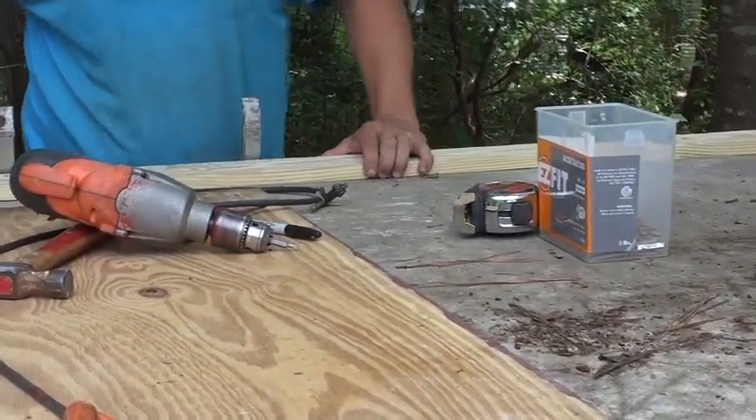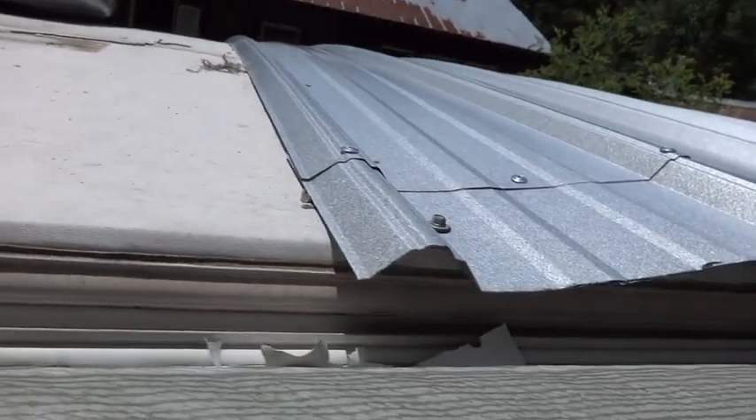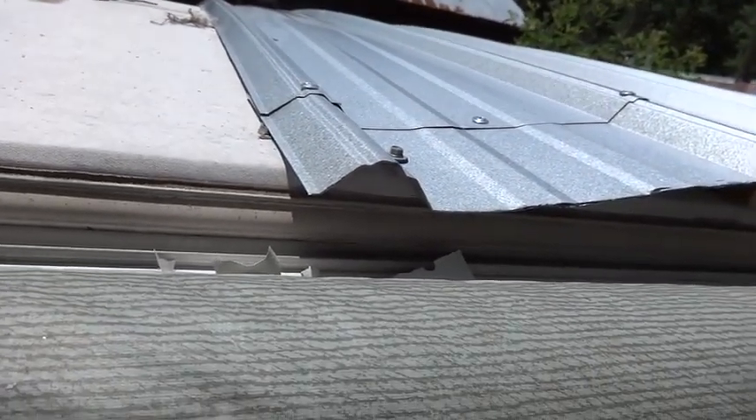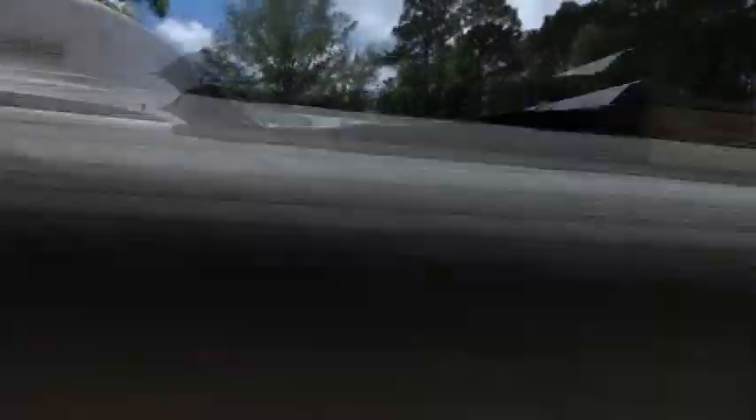See how we finished it off right here — we run the tin off the one-by-four right down onto the roof, and see how it hugs the roof across there. I could caulk across there and seal it off real good. And if I ever felt I needed to add more coverage, I could take that screw out, add some more wood underneath, and continue on to the back with more tin and more wood.